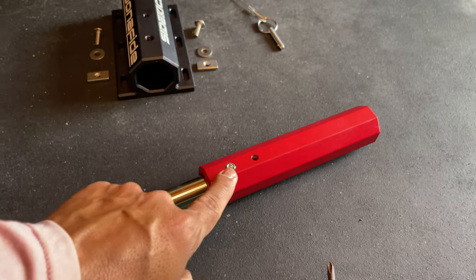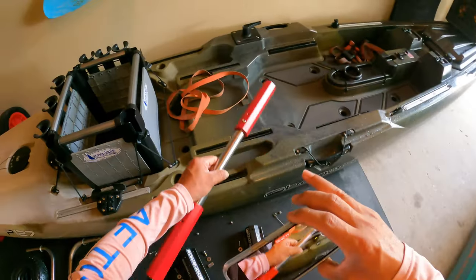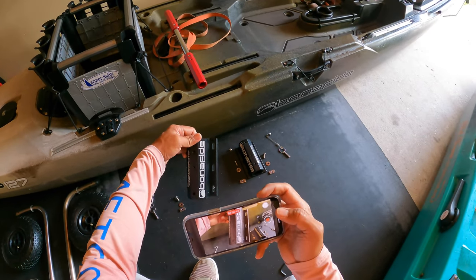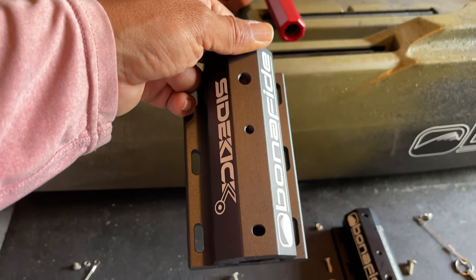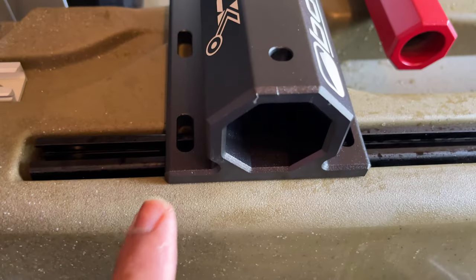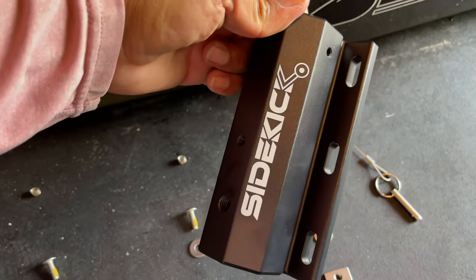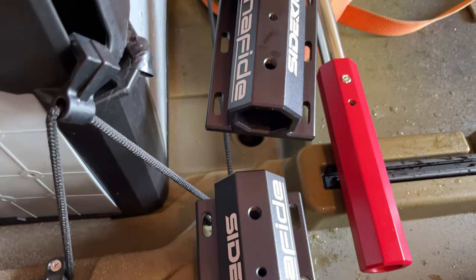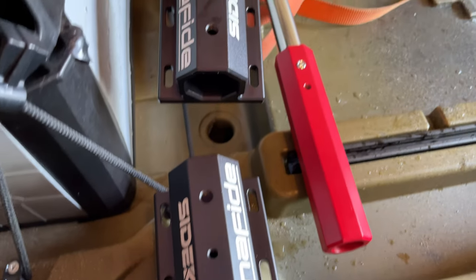We'll do the same thing on this side, repeating the process and making sure that we have an inch worth of space backed off. You want to make sure that both sides are lined up so the pre-drilled holes are both at the uppermost. We're going to start our knuckle installation on the starboard side — that's the Bonafide facing forward. You can see there are two pre-drilled holes right there facing inward, and the single one is going to be outward. We'll use these two holes, and then do the exact opposite with the Sidekick facing towards the bow — the two holes pre-drilled facing inward, and the single hole facing outboard on both sides.